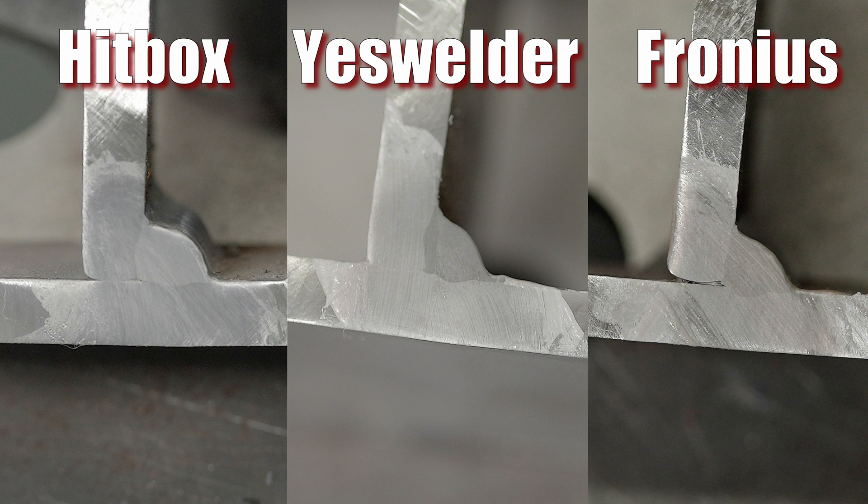The cut and etch results on each of these welds are all relatively similar, and that's not too surprising considering none of these welders will go much above 3,000 watts of output on 120 volts. I did clean the mill scale off of the weld area on each of these pieces, but I didn't otherwise do anything particularly special to try and get maximum penetration. You may be able to get a bit better results with different technique on different joint setups, but I think the main takeaway is that regardless of the welder, short arc MIG with 75/25 shielding gas running on 120 volts is going to struggle with 3/16 inch material. For a non-critical application these would probably hold up okay, but in a critical application — especially something with heavy dynamic loads — you'd probably be better off running flux core if you need to weld thicker material than 1/8 inch on 120 volts.